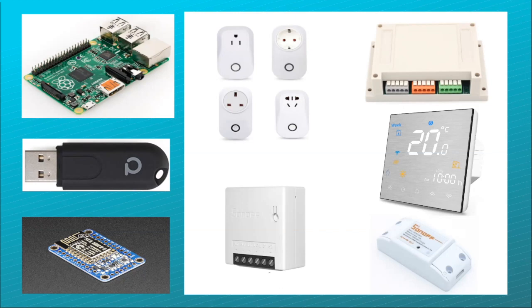Now, these devices in the big white box, these are things you control or you monitor, okay? Because these will provide you information, how much power it's using, whether it's on, whether it's off. And you can use these so that if you hit a button on one of your outlets, that turns on the light locally, it can also tell the rest of your home automation, oh, if you're going to turn that light on, you want all the rest of the lights in the room also on. So you don't have to rewire everything. It's a great way of doing wiring stuff without actually having to do the wiring.